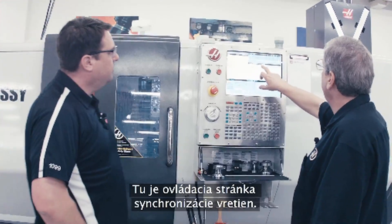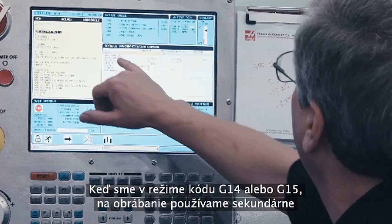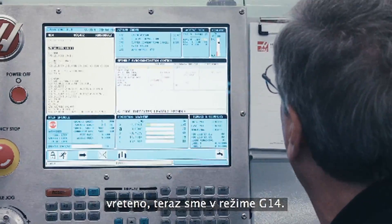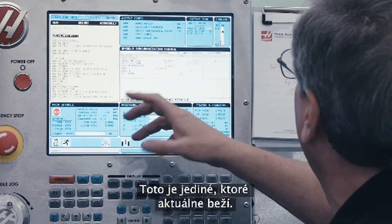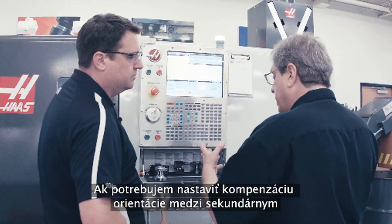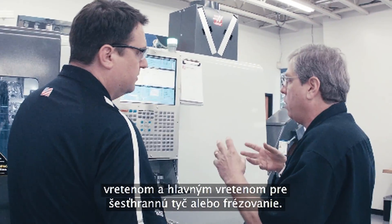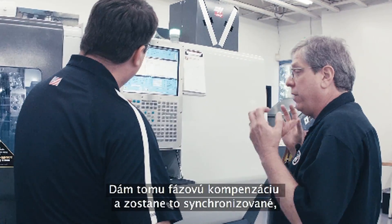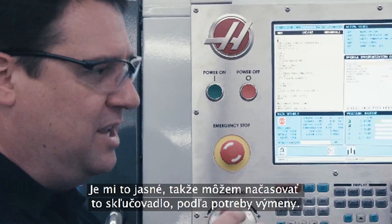Here's our spindle synchronization control page. What this does is tell us the status of both spindles — essentially whether we're in G14 or G15 mode. We're machining on the secondary spindle now, so we're in G14 mode. This is giving me the position of the two spindles; this one's the only one running at this time. And then we've got this phase offset, which is an R-code. If I needed to offset the orientation between the secondary spindle and the main spindle for hex stock or milled features — to make sure they line up — I give it a phase offset and they'll stay synchronized at the proper orientation. So I can clock that spindle how I need on exchange.